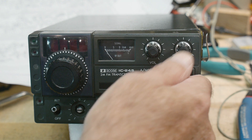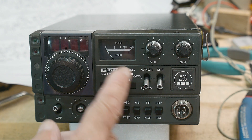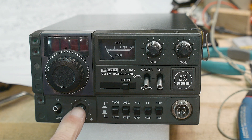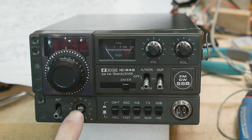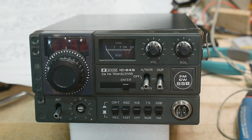It's FM, and it'll do duplex or simplex. It's got some noise circuitry, volume and squelch, and a meter that'll measure signal strength or RF output. It's a 10-watt radio, 144 to 148 megahertz. It's missing a knob — the RIT knob — but I'll find or make a replacement, which'll be some machine shop work.